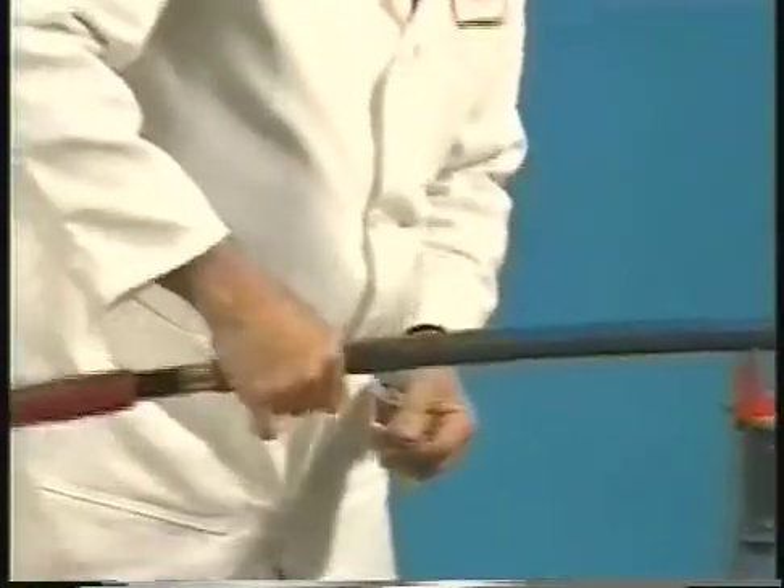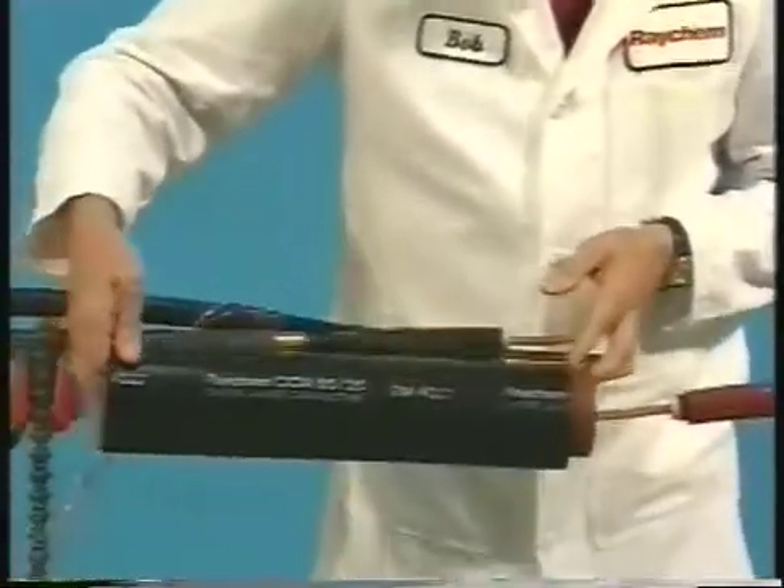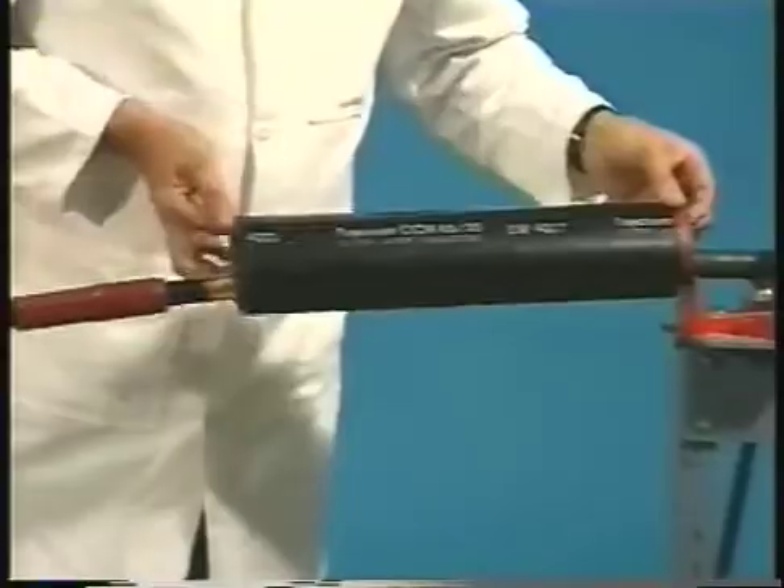Clean the main cable jacket as shown using an approved solvent like Raychem's P63 prep kit. Nest the red insulating tube within the black-red dual layer tube and slide them over the single cable side of the splice. Keep in mind that these tubes should be kept clean during the installation of the connector.